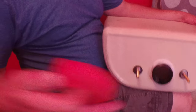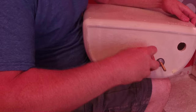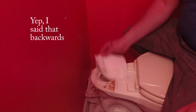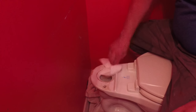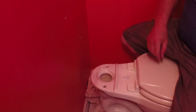Now we need the rubber seal — it just slips over the drain opening. There's a notch where it locks in, so everything is covered and you've got a nice seal. Make sure the top of the tank where the bowl connects is clean too — you want the seals going to a clean surface.